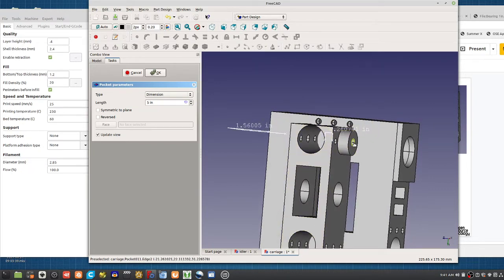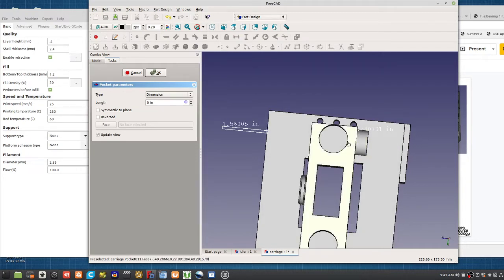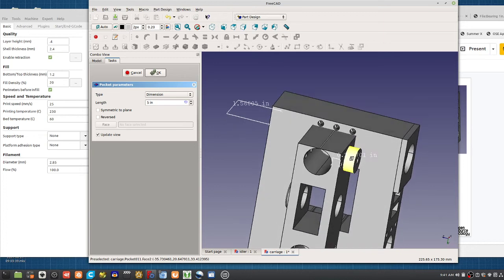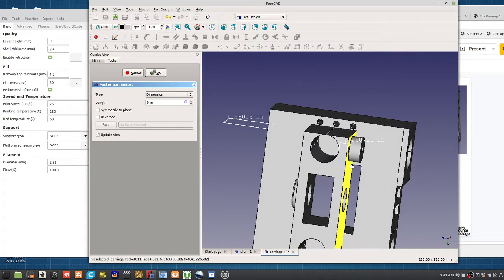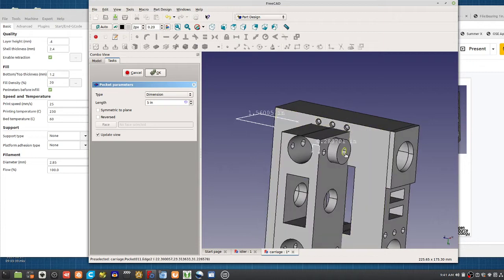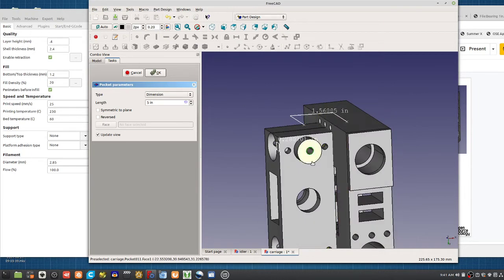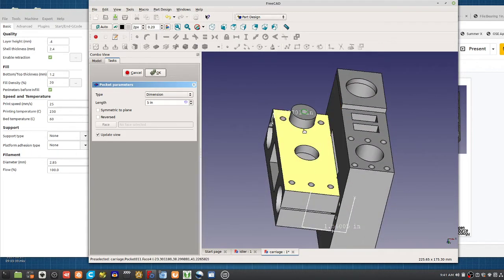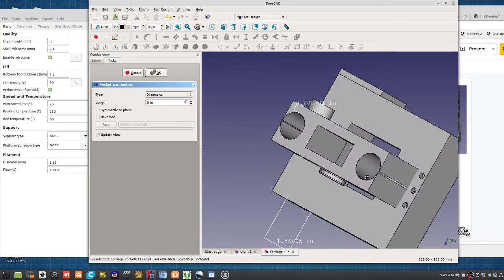So if you put a 1/4 inch bolt, its clamp force, through about 3/4 inches of plastic, it's like having a nylon washer that's 3/4 inches long. That's a lot of grab. So the point is, if you put a bolt through this, threaded through to the rod that would be here, there's a lot of grab there. So it's just a point of how you design these things. You don't need to make the entire side thicker, just put a bump on this to make it work.